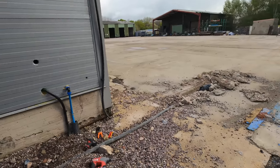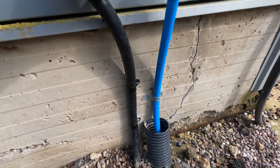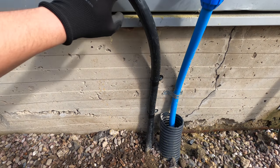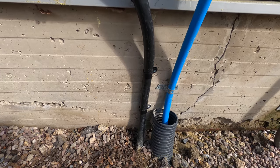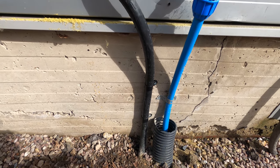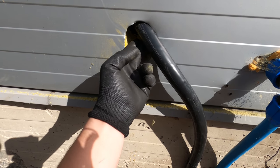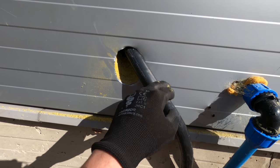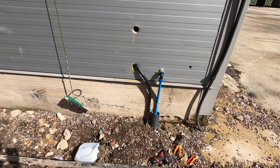The GoPro died, but basically these cleats are too small — it's standard, really. It happens all the time with these new cleats. That's the only downside of them — I think the sizes are either slightly off or the wholesalers can't get their heads around them. They're just pinching. I've left them in because I want to crack on with the rest of the job. This cable can stay in situ, I can do everything, and then when it comes to just swapping these out for the right size I won't have to force a cable or gain any slack. I also bent this lip over so there's no damage being put on the sheath of the cable.